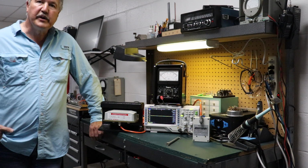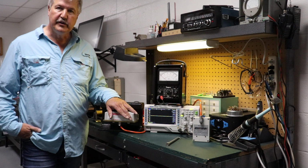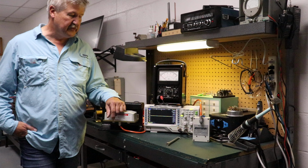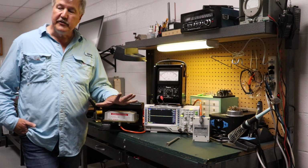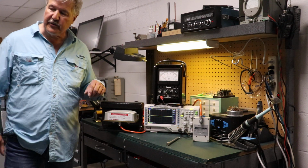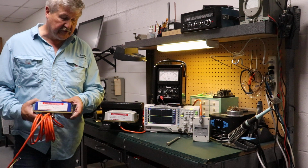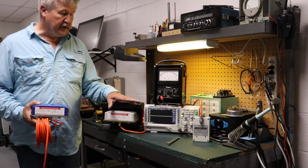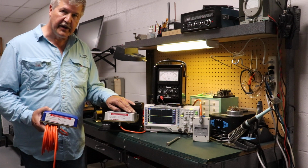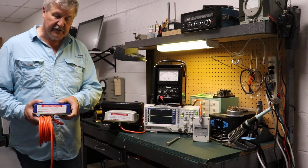Today we're going to talk about how to adjust the 200 series non-vital Pintsch wheel sensor, also commonly called the Tiefenbach wheel sensor. Generally speaking, Pintsch manufactures several different types of sensors. But in the case of the 200 series and the 400 series, they're slightly different. Over here you can see this one's gray, and that indicates that it's a 200 series non-vital wheel sensor. The blue sensors are a vital wheel sensor.